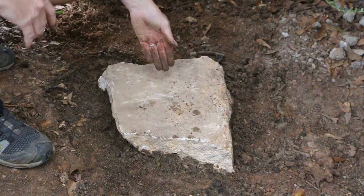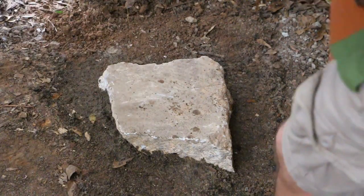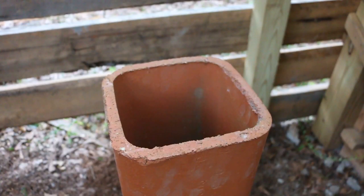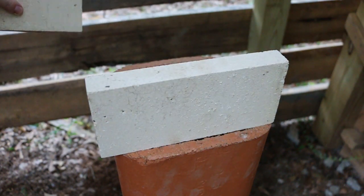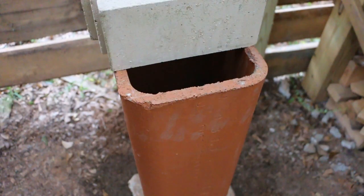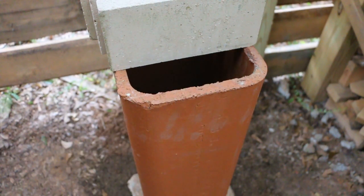An alternative to using a piece of salvaged concrete like this would be to cast the base. The flue pipe is going to sit on here just like this. Flue liner is not made to handle high temperatures, just the smoke in the chimney. So I'm actually going to create an insulated firebox with the firebrick — it's going to go inside the dimension of the flue liner. I'm going to have to cut down a firebrick to fit inside the back, and cut an opening in the front to provide for a firebox and the feed ramp. So let's mark this up and make some cuts with the grinder.